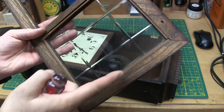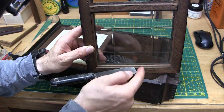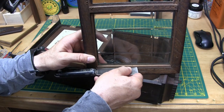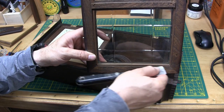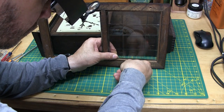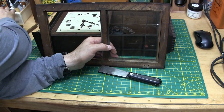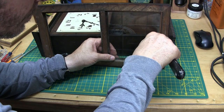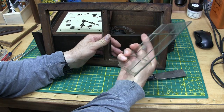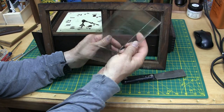I'm just going to pull these little brad nails out, take these wood pieces out, and take the glass out. If you just insert a screwdriver and push up, you'll make little indentations in the wood — undesirable indentations — so it's better to use something flat. It just had a little seal there that you had to break. This glass should come out. You can see it's all one nice piece. That's pretty irreplaceable — I don't know how you'd ever replace something with that etching. Just needs some cleaning.